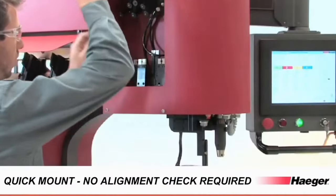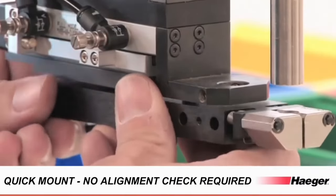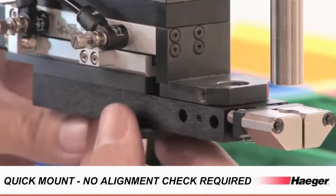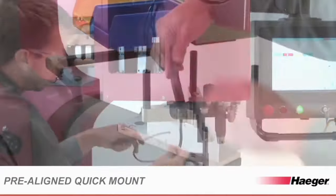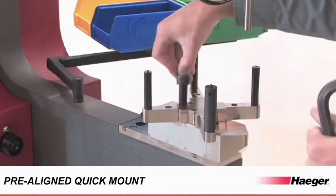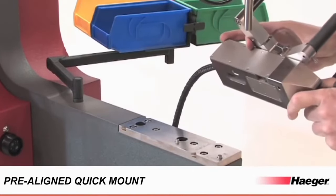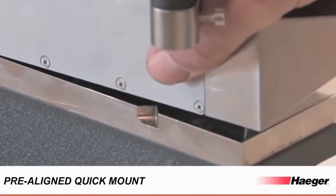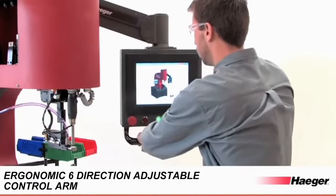The OneTouch 4E includes many new features designed to increase operator efficiency. Some of these include quick and easy tool retrieval, 3-second tool change on the bowl feeder, pre-aligned shuttle platform with integrated air and sensor cable connectors for quick disconnect and reconnect of the shuttle, turret insertion system version 3, and full process control in station 1, including fastener detection, fastener length detection, and insertion mapping.